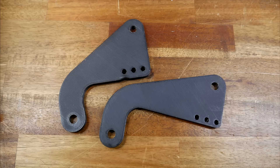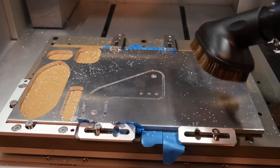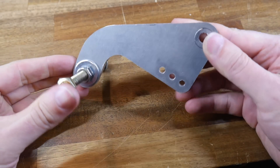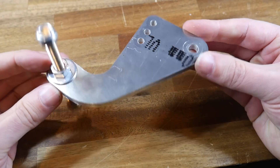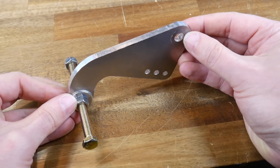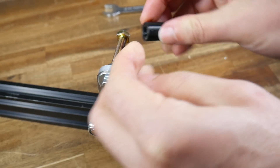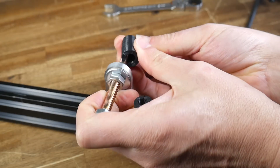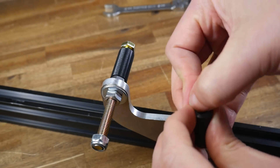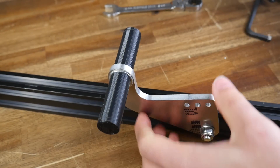I iterated the anchor design a couple of times to get it in the ideal position before milling the final version from 6mm aluminium using the Carvera desktop CNC. This part, like all of those I make on this machine, turned out beautifully. It's not a cheap machine, but compared to paying someone else to manufacture it, the Carvera is an ideal solution. To finish off the anchor, I printed several TPU — which is like rubber — bushings and covers. These are printed completely solid so they're quite firm, but they still have enough flex to go over the bolt. The same goes for the sleeves, which are tight enough to form a nice interference fit and stay in place.